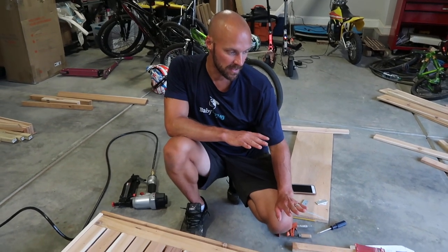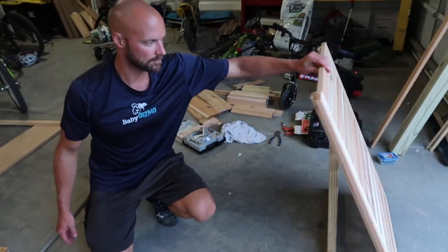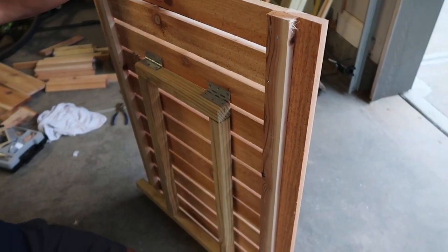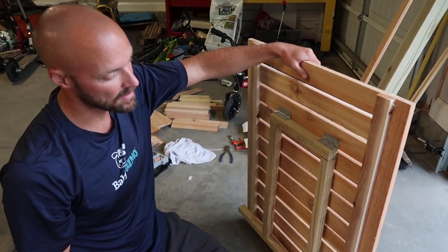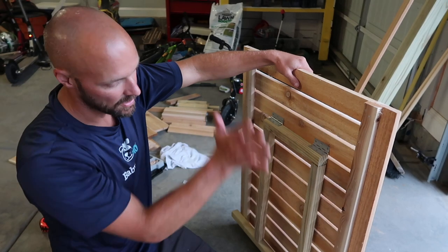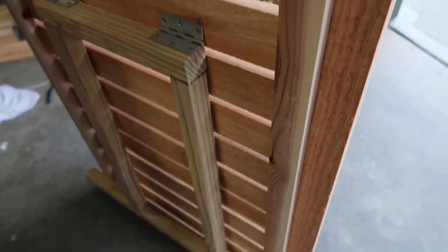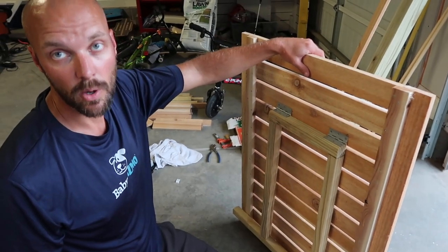The last part is connecting the header piece—and here's the mistake we made. We put extra supports in, which seemed like a great idea, except our nail gun has some super powers and the nails went through even though it looked like they wouldn't. Not a big deal—we bent them down and I'll probably put some kind of decorative strip over it, glue it, stain it so you won't see it. They're not sharp. If you're a perfectionist, you're going to be upset about it, but you'll get over it. We're going to put the hinges in and show you the whole thing working.